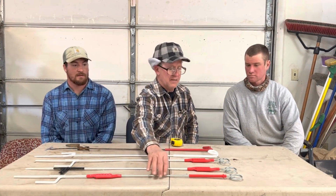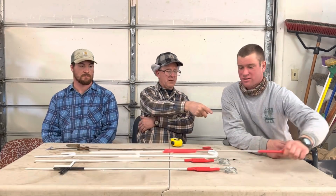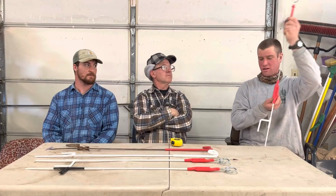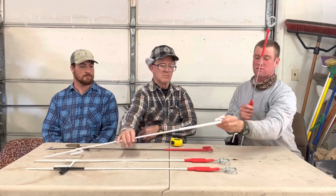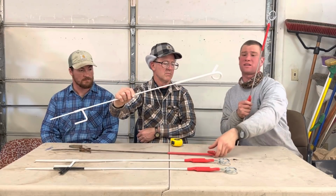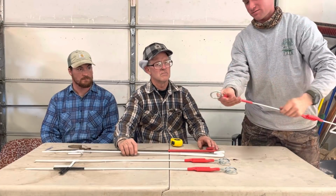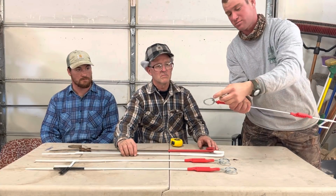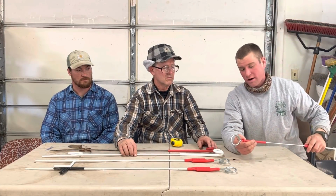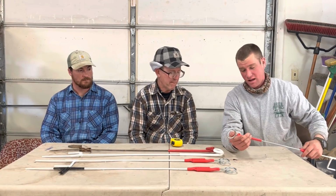David, do you want to talk about this first post? What's the difference on that one? Well, first of all, the pigtail shape. This one's super unique, of all these posts here. So the pigtail, these two here, if you look, you can see how it's got that extra tab sticking out, 1.5 inches. That just makes it easier to get the wire in the pigtail. On this one, you don't have that extra tab sticking out, so it's going to be harder to get the wire in there. It's more compact. Yeah. Once it's in there, it's going to stay.